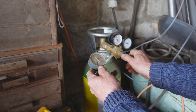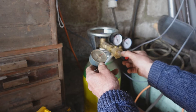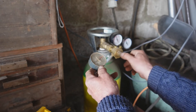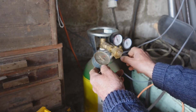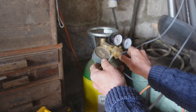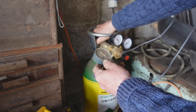Starting at zero: 2 litres per minute reads just over a tenth of a bar. 4 litres per minute at six tenths of a bar. 6 litres per minute at one and a tenth bars. 8 litres per minute at 1.7 bar. And 10 litres per minute at 2.3 bar. So now we know nothing.